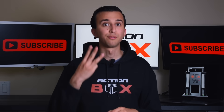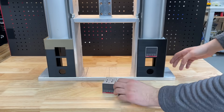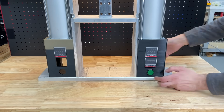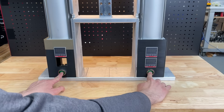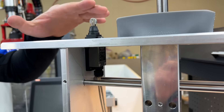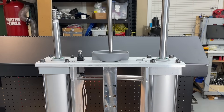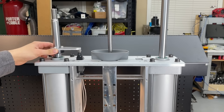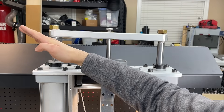For electronics, we have three main items. First, the PID temperature controllers that fit perfectly into our custom housing. Next, the injection switches connected in series so both must be pressed for injection to occur — a new safety feature. Lastly, our favorite improvement: a limit switch that deactivates the pneumatic cylinders at a specified distance, using a custom clamp that slides over the cylinder rod. We also have a stopper to prevent the crossbar from being pulled unevenly.